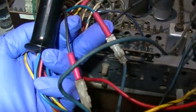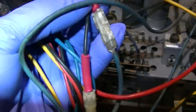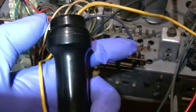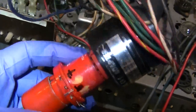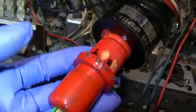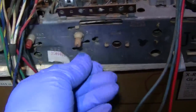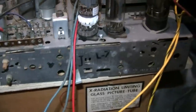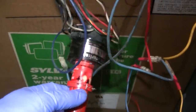A roundy is pretty simple - it has one yoke adapter because on round tube color sets the yoke plugs are just spade connectors, flat blade connectors. There are matching components in the adapter: resistors and capacitors, plus a contraption to get from the roundy style CRT plug to the more modern color CRT connection. Next we want to kill the screens or G2. We have a normal service switch. I'm considering leaving the CRT unplugged and measuring voltages first, but the CRT is damaged so let's just go for it.